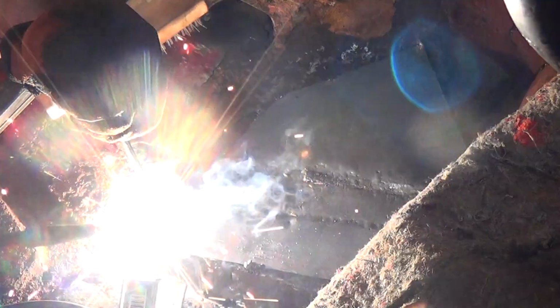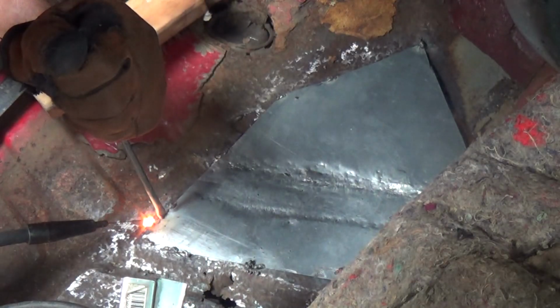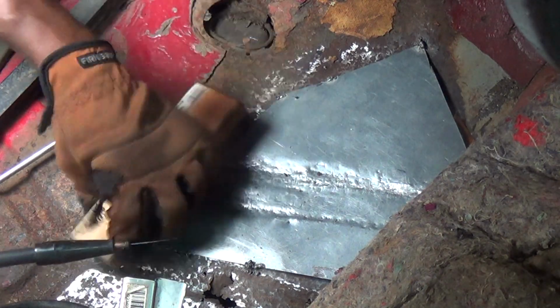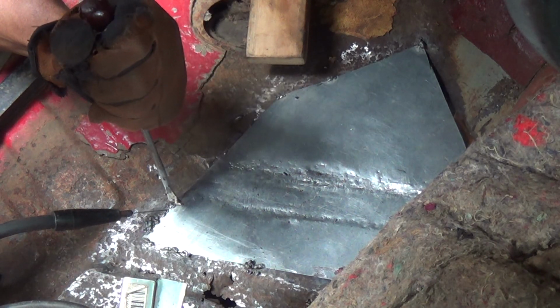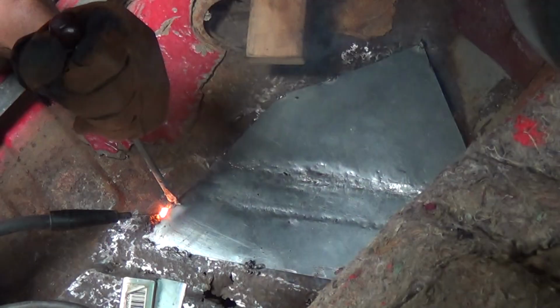I'm just tacking back and forth to the weld itself. Seal up the hole. There you go. One guy had showed me some welding techniques, showed me you could do that. Because it's all metal. As long as you're just filling it in, right? Yeah, it makes sense to me. There's nothing that has to be pretty. Because that's what a grinder can do. The main thing is definitely porosity, right? And I said, yes. And penetration. I'm sorry, penetration.